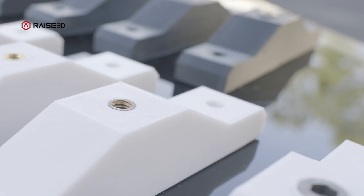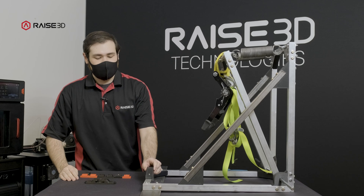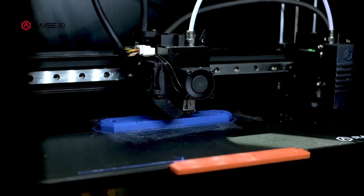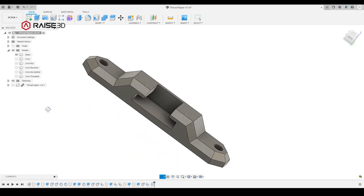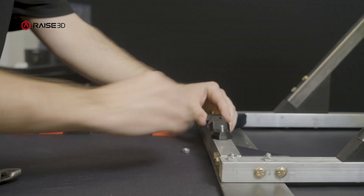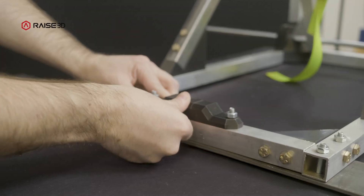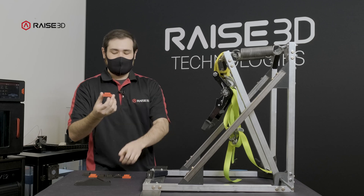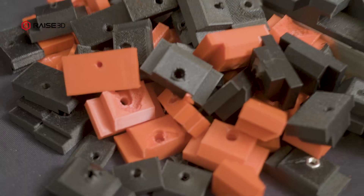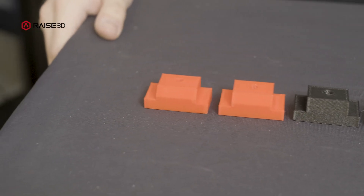The original pieces were these huge blocks that used a lot of extra material — they took about five hours to print at 50% density. The new design uses a carbon fiber nylon printed base at 90% infill, always mounted to the frame, and instead of using the full block I've switched to much smaller insertable core designs. So versus five hours to print one of these, I can knock one out in about 45 minutes. We have a lot more to test and we'll be going through a bunch of different design styles for the various ways to put threads into your parts.